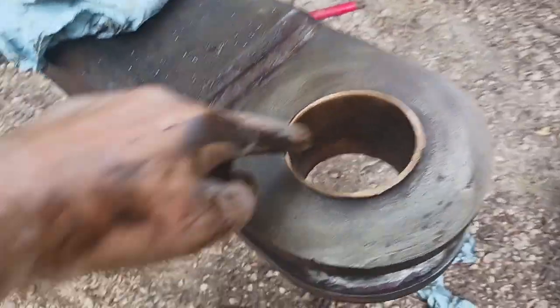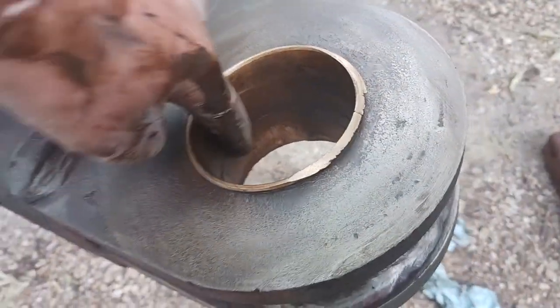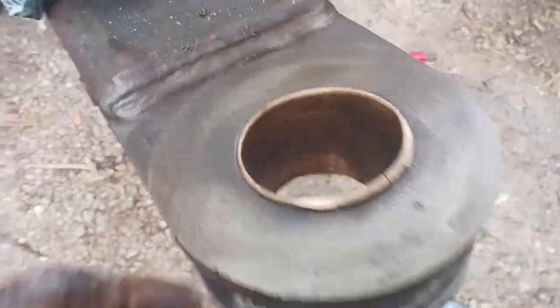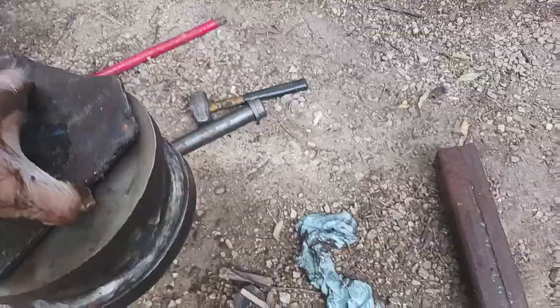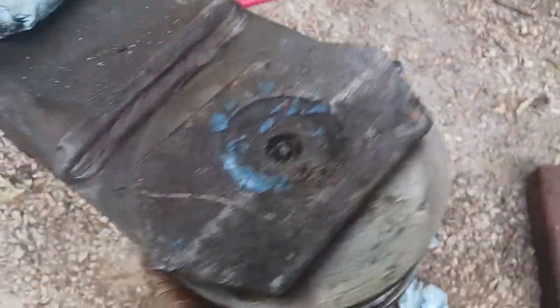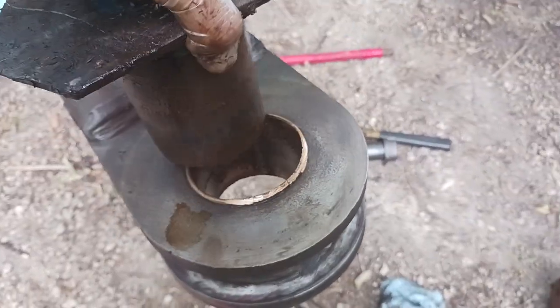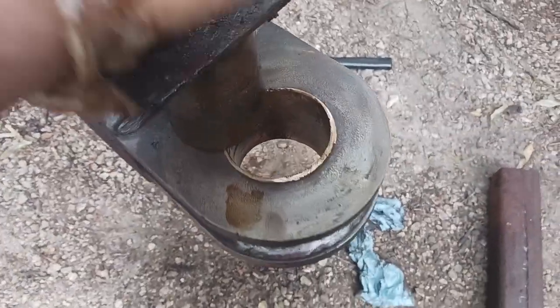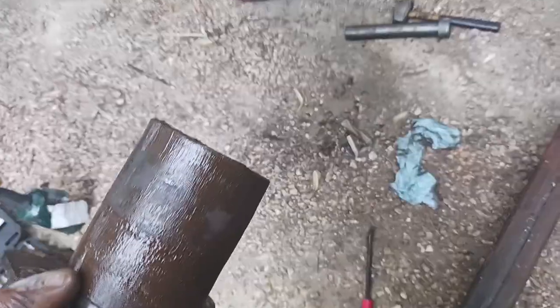Now that it's clean, you can see there's actually a bronze bushing in here. There are little rings inside that bushing which are supposed to help grease flow throughout it and get to different areas. This is steel, and this is the pivot pin that goes inside that bronze bushing — it's supposed to be tight with zero play. But as you can see, there's quite a bit of wiggle in there. That's supposed to be very tight, so I should get a new bronze bushing as well. They're not terribly hard to put in, but they still suck. I think I'm just going to do the wear rings and see how much the bushing is.